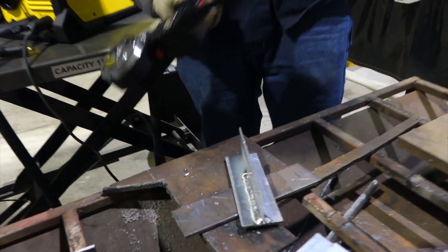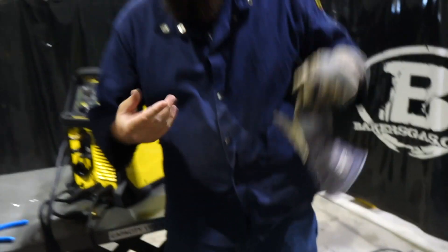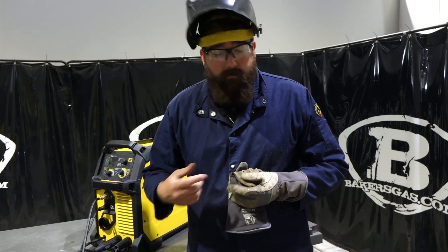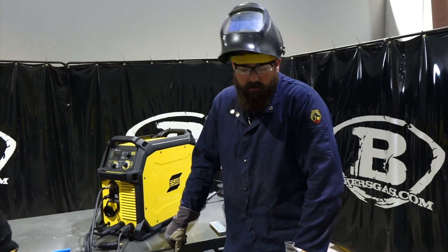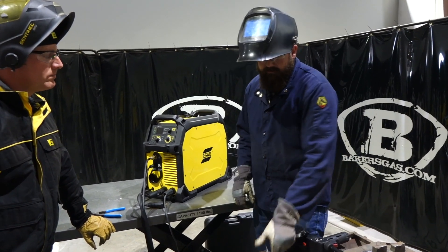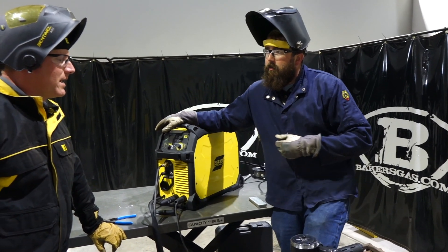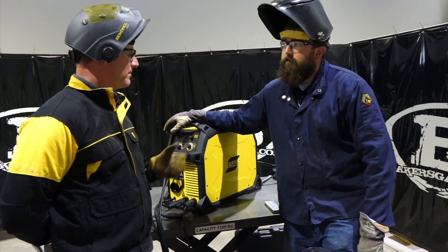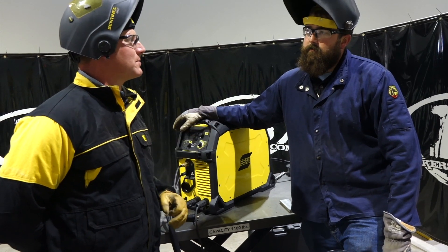Not too bad at all — really pretty nice. Some applications where this thing would come in handy: boat docks come to mind, pontoon boats, aluminum ramps, railing, probably some stadium stairs — I've seen bleachers that would need a spool gun for that. Maximum thickness you can run: customers regularly run quarter inch aluminum with it. I've gone as much as half inch — half inch you're kind of pushing it, but you'd want to move up a diameter in wire to carry more amperage and get more heat. Go to an 045 and that larger diameter will carry that much more amperage.